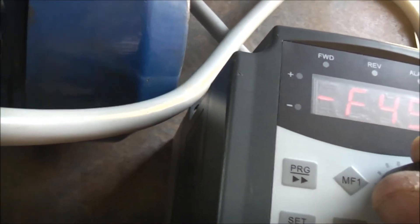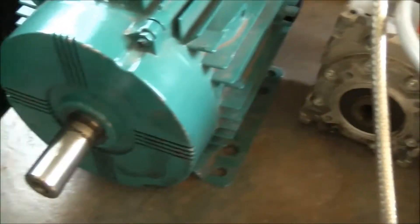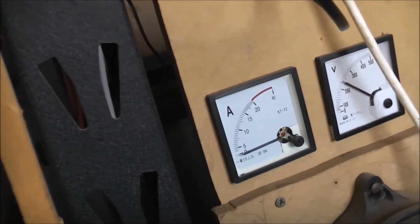There are 50 categories in that group you can adjust. As I said, I've done a factory reset - I don't know if that'll just fix everything up or any mistakes you may have made. It did do a factory reset but it still does this thing when it goes to run the motor: EPG fault. I don't know why - it's not any stupid amounts of current.